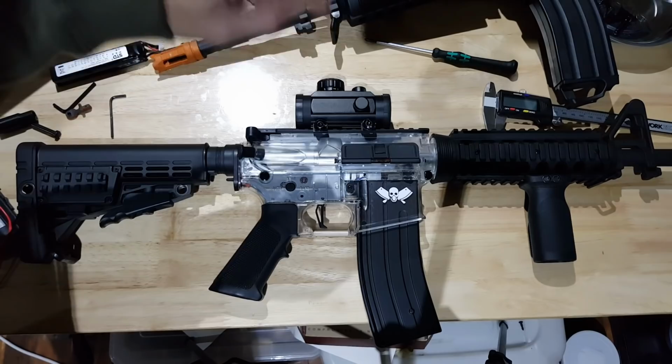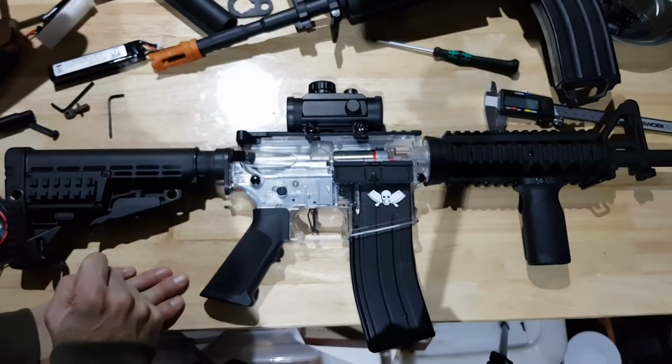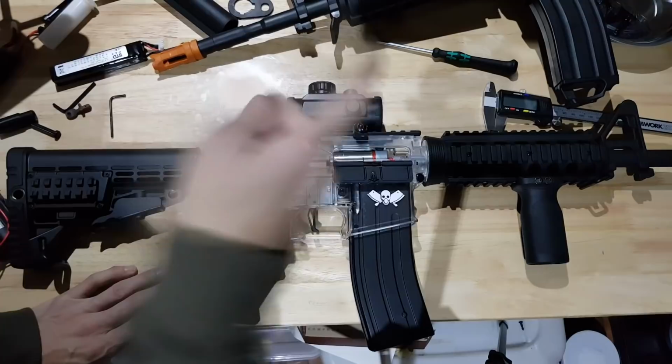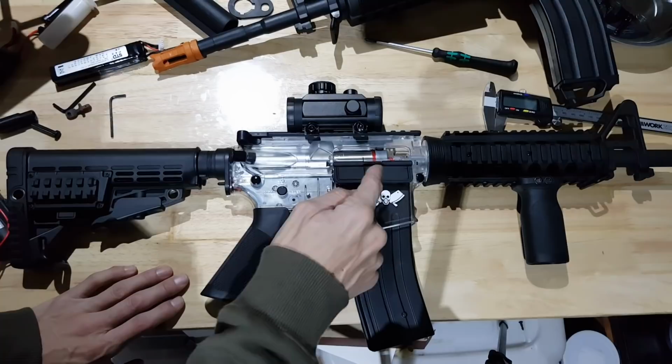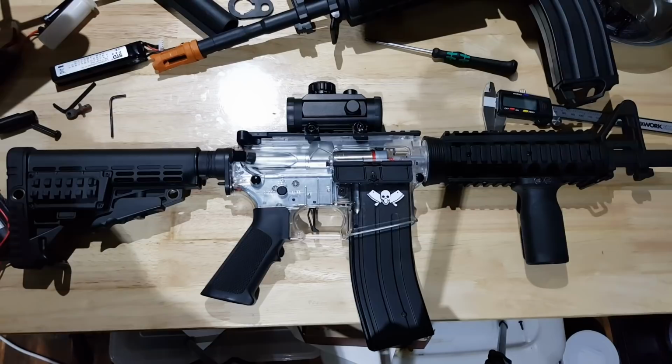Best with an aluminium Wells cylinder head and the 100% Wells cylinder. That gives you the good seal on the T-piece. Wells tappet plate modified to fit. Slight shaving of the internal rails inside the gearbox for the tappet plate. What else we got? I think that covers it.